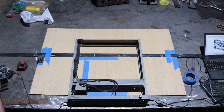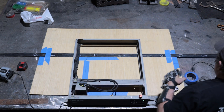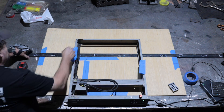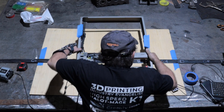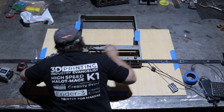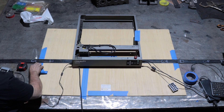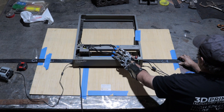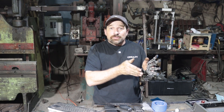Once all the panels are engraved along one side of the fixture, it's time to reset the flat bar. For my setup, I use a 1-2-3 block to mark a layout line three inches towards the bottom of the material. Mark this position on the blue tape and move the flat bar down to where it's a little over an eighth of an inch off that line. The real number for my setup is 2.85 inches down, or 150 thousandths up from the new layout line. At this time, I reposition the laser from using the cones on the back feet to using the ones on the front feet. Make sure you haven't shifted the flat bar left or right — that's where the sharpie mark made earlier, referencing the edge of the wood to the flat bar, really comes in handy.